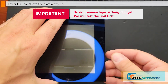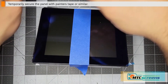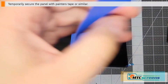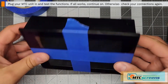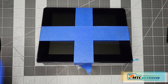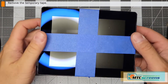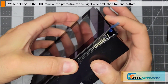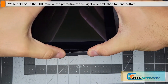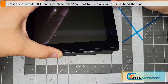With the right side sitting there, reach in, grab that white driver plug and snap that back into its connection — it just pushes into place, it's a friction fit, push until it stops and make sure it's nice and even. The LCD panel is now sitting in the plastic tray with the backing film still intact. Temporarily secure that panel to your plastic housing with blue painter's tape or scotch tape so it doesn't fall out during the test. Take the unit, put it in your boat, and test your functions to make sure everything's responding correctly.